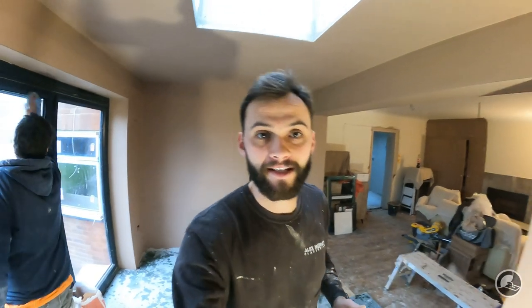So if we go back to the corner that we've been starting with, you can see there's just a small amount of fat in the corners from the wet trowel, and lots of pressure pushing down into the corner. And there we have it. And then the only other thing to do is just use your brush and then just gently brush the corner like so. Now what I'll do is I'll go around and twitch the rest of the corners. But that pretty much is it.